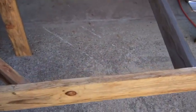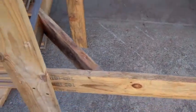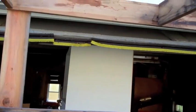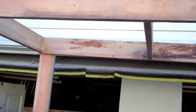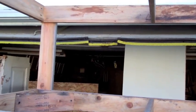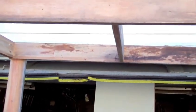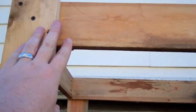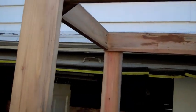By the time I get the 1/2-inch ply in here, there's going to be 14.5 inches, 13.5 inches in this gap, and 12.5 inches in the top gap. So basically I've got plenty of room, and I'm going to put a sheet of 1/2-inch ply on top, and it's only going to be about 6 to 8 inches from my ceiling. I don't remember how high it was now, so it's not going to be real high, but it's going to be enough to store a bunch of our overstock boxes and all that kind of thing. I'll probably come back in here and trim in another piece right here so this is level and flat, so I can put some doors on it.